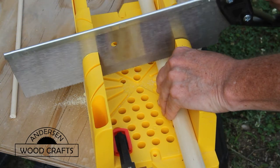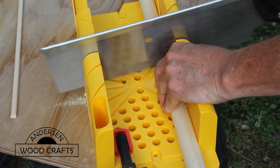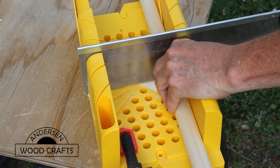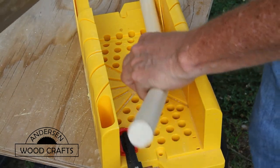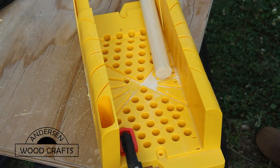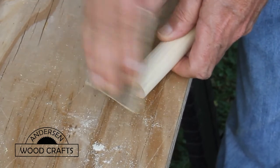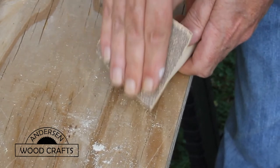To cut the dowel that will be the center post, I'm going to use a miter box. The smaller dowel was small enough that I didn't have to use the saw — all I did was use a straight razor, score the surfaces, and then snap it. Then a little sanding on the dowel. This does two things: on the exposed piece it takes away the sharp edges, and on the piece going into the hole, chamfering it makes it a little bit easier to slide in.